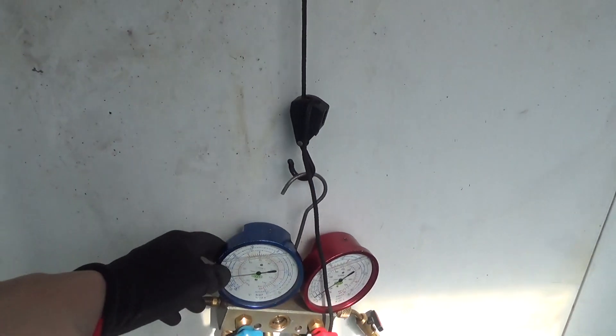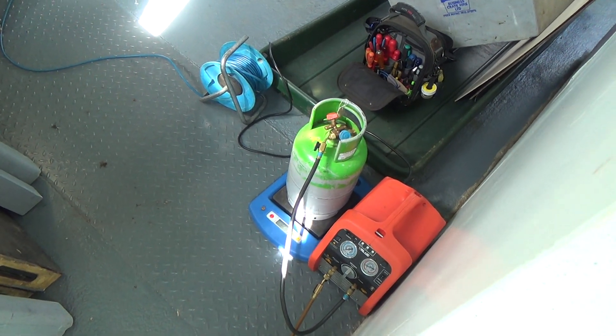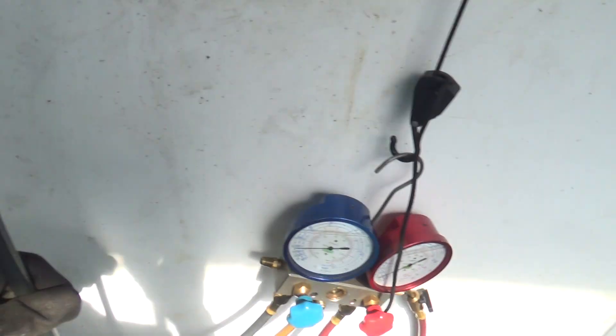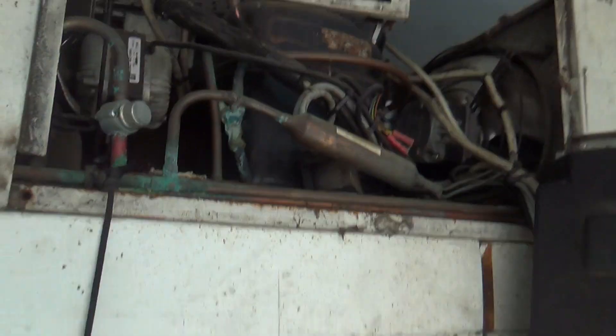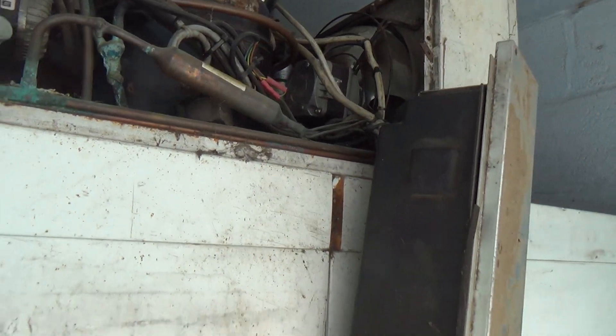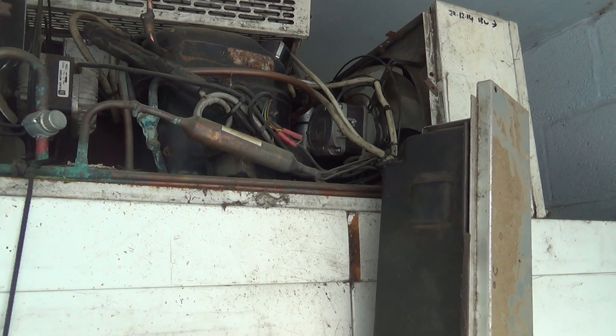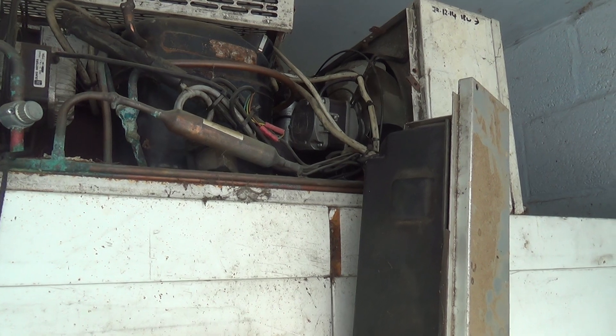I've got the gas took out of it — it's only got a tiny bit in there, R22 — which took out 210 grams. It might be 270, so maybe it's got 300 grams in it. I don't know what it holds normally — 750 — so yeah, about a third of a charge. And the compressor was making some funny noises too.